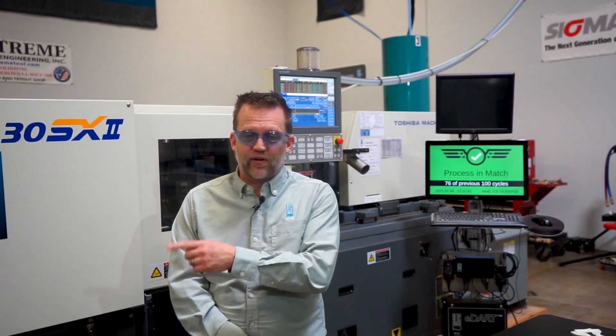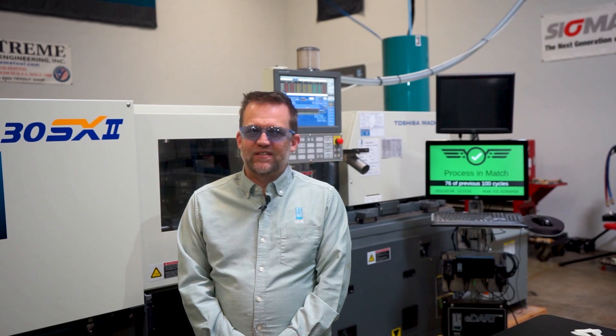What I didn't do was just go change a bunch of settings on the machine — I've been guilty of that in the past — but you need to do a little investigation work. Check the easy stuff first, walk around the machine at least twice, and look at the things you assume are always correct to make sure a simple cause isn't driving your issue. That's good practice for any troubleshooting technique, whether it's a visual defect, a short shot, or even flash. Resist the urge to push buttons and change things quickly, because usually you're just band-aiding the issue. Thank you guys, I hope this helped — stay tuned to our channel for future videos. Have a good day.